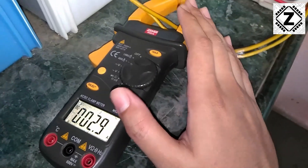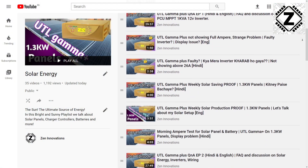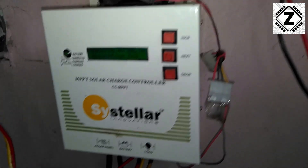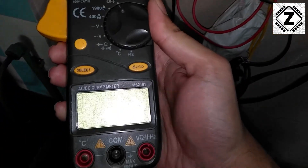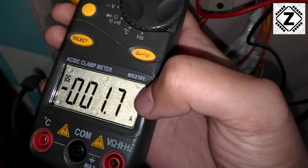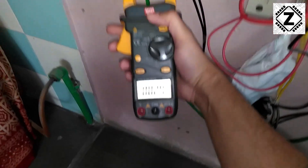That was how you measure amps of your battery. Now let's go ahead to measure the amps of your solar panel. If you are interested in solar energy, I have a giant playlist waiting for you in the description. Over here I have my solar system connected to this charge controller — the link to review the Cy Stellar charge controller will be in the description below. We will follow the same procedure: go to the 400 amps range. As you can see, with all the electronics here the display was showing a dummy reading of around 1.3 amps, so right before using the clamp meter we are going to hit this zero button.